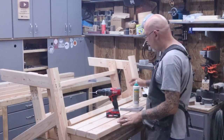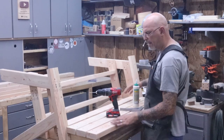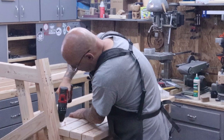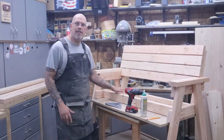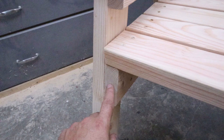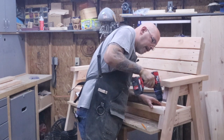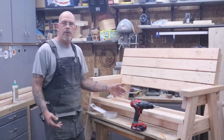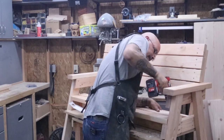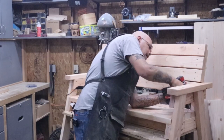Tip the bench on its back and take the 44-inch piece — our smallest piece — and space it out on the back of the top at the bottom, following all the same steps: square, pencils for spacers, glue, and screw. To add the seat slats, do the same thing — line our 2x4 up with the beveled edge of the seat support. Note that you'll have to angle your drill bit to get around the arm support. Mark it, glue it, pre-drill it, and put our screws in. Follow the same procedure all the way to the back, spacing with pencils, gluing, pre-drilling, and screwing down to the end.